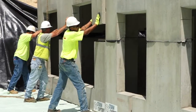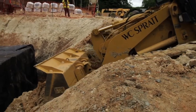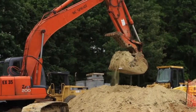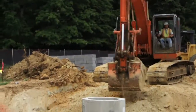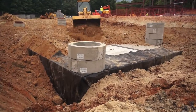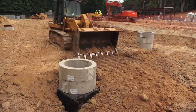When it's delivered to the site, it's immediately HS-20 traffic rated, so there are no structural concerns. You could backfill it with dirt, rock, mud, or gravel and it works any way you want. Storm Capture is constructed of structural precast reinforced concrete for easy and rapid backfilling, and can withstand job site abuse that many products cannot.